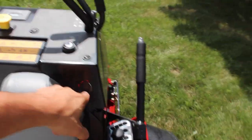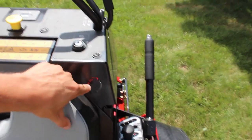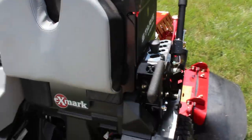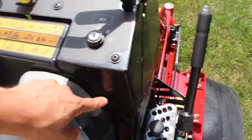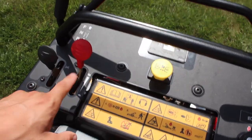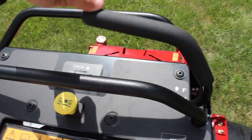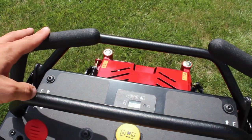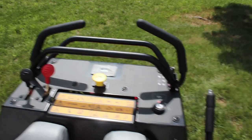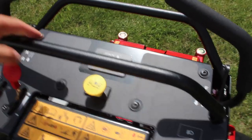Let me show you pretty much everything up here. You have a little spot that I'm assuming you can put a charger or something like that. There is a certain chute that my buddy was talking about — like a switch that maybe you can mount here. But here's your key ignition, PTO switch, choke and throttle. Apparently some standers have their safety in the pad right here, but no — the safety is in both of these throttle levers. Some have it in one; it is in both. So if you slightly push one down and you step off, it will stop. That little bit of fidginess is one thing that annoys me.